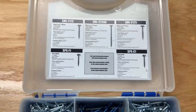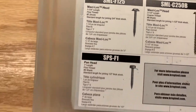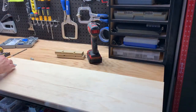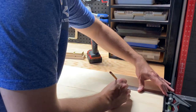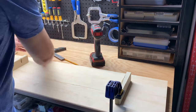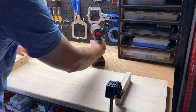Use the chart to determine what size screw you need. I used a one-and-one-quarter inch pocket hole screw for joining three-quarter inch thick stock. Earlier we marked a line to determine where to place the legs — I marked six inches in on each side and ensured the marks were square. Place the legs on the marked lines and clamp them down. I placed each screw in the pocket hole and drilled each one. You can use other options such as glue and brad nails, which would be sufficient as well.